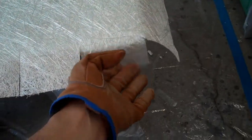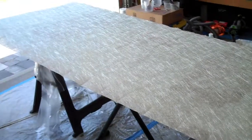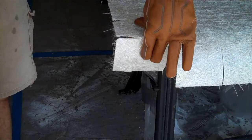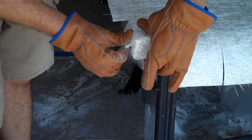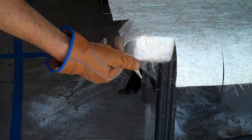And all the way around, this bottom piece is going to be wrapping around there, and then when I put the last top layer on, the last top layer will wrap back around. So I'll have two layers of chopped strand mat going around all the corners, and the top layer will be wrapping to the bottom to make the top level the neatest looking one. This is how I'm going to fold things around this 2x4. This guy goes down, this one goes over and down, and then this guy goes over here. So that's the plan for making that corner somewhat neat.